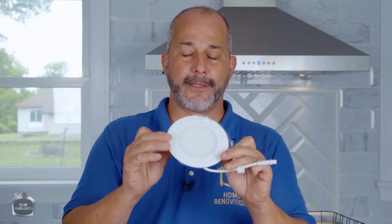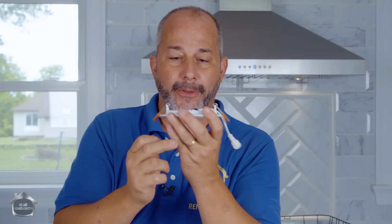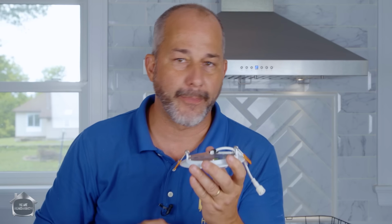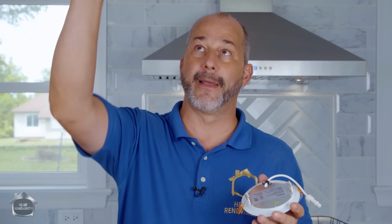The other thing that these lights can do is they can go into your ceiling if it's an insulated attic space. Building code and electrical code allows us to just cut the hole, snap this into the drywall. We don't need any vapor barrier protection in there or anything, okay? You can just slide all this up into the attic and you are good to go. So, retrofitting an existing space and adding some lights in an attic is easy. All you gotta do is fish a wire from that center light, put it to the four corners of the room, and you can add pot lighting to your room.